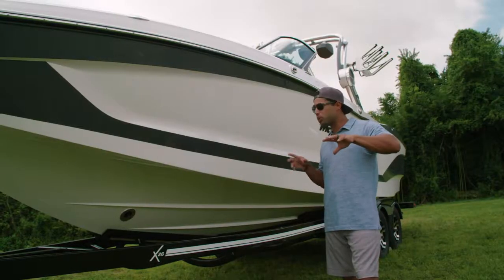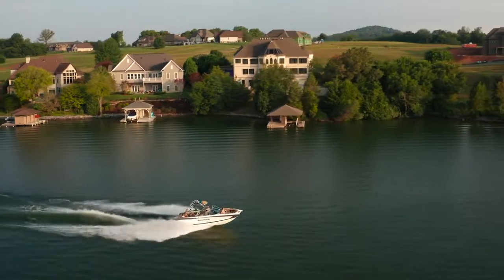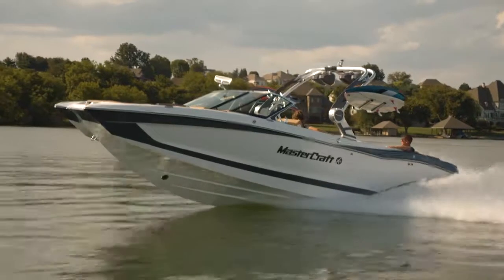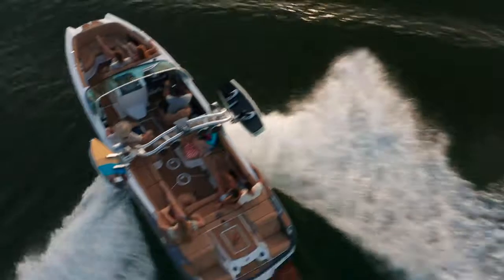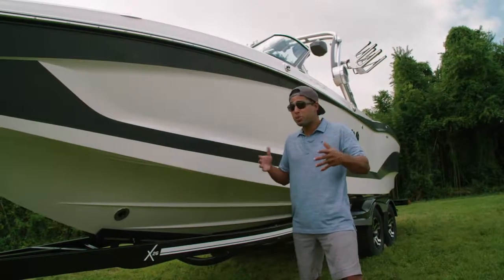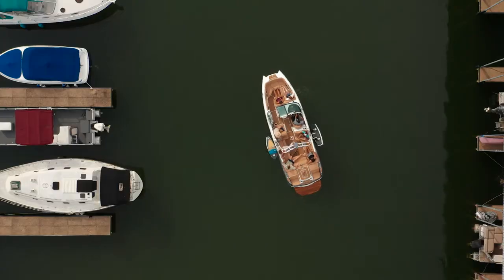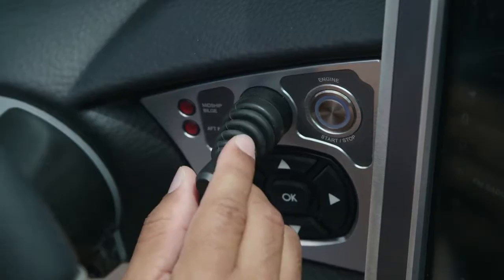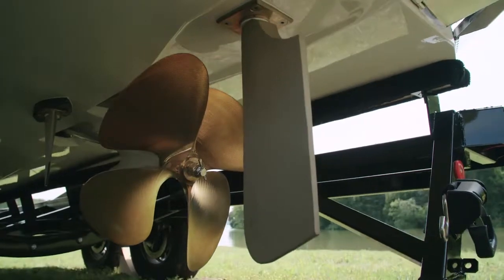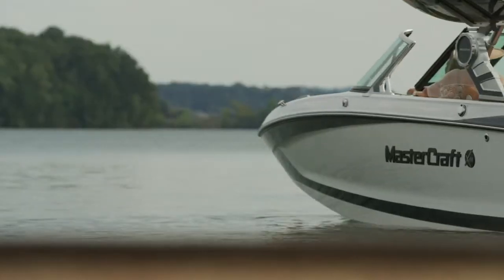In addition to the refined helm experience, we've also put a lot of focus and engineering into the ride and drive of the new X26. Up on the bow, we've got a much steeper dead rise forward, which allows you on big open water to still have a very nice, comfortable, and predictable ride for your entire crew. We've also worked on agility — this boat is almost 7,000 pounds, so we've added optional bow thrusters to make maneuvering around a marina or close to a dock much easier and more responsive. We've also improved agility by adding a taller main rudder, giving you more responsiveness whether you're at wakeboard speed, cruising, or at idle around the dock.